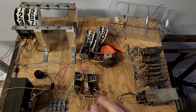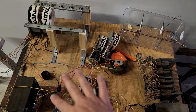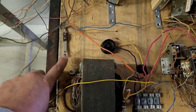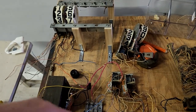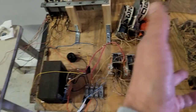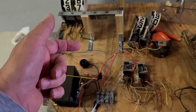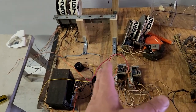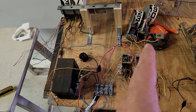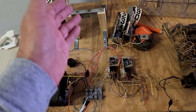So far I had the score reel sitting on the ground and set it up so that every time I pushed the leaf switch it would click one minute. At the end of ten minutes, using the standard score reel setup, it would click over and make the tens digit advance once back to zero. That continued all the way up to 60 minutes — but at 60 you hit six-zero and you can't just roll over at ten, it has to stop at six. That's where the relays come in.